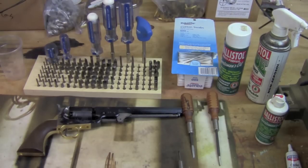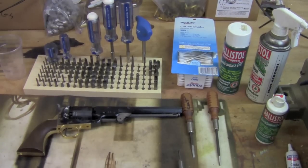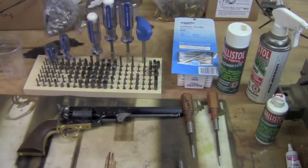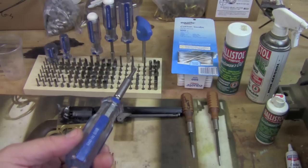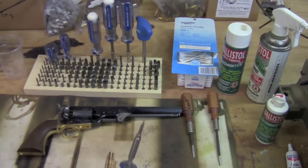The first thing we ought to talk about is screwdrivers and tools in general. You really don't need that much to take apart cap and ball revolvers — for disassembly you only need two basic tool groups. You're going to need a nipple wrench — this one is a Track of the Wolf nipple wrench sized for revolvers — that's important if you're going to take apart the gun after firing. And you need good screwdrivers. These are really critical for black powder guns because they have to be disassembled to be cleaned, and if you don't have good screwdrivers you're going to mess up the screw heads. These Italian guns do not have the strongest screw heads and it's very easy to bugger them up with ill-fitting screwdrivers.